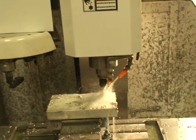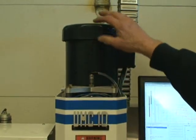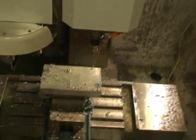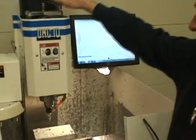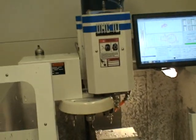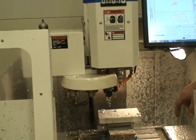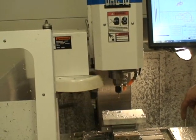Why it's noisy is this motor is an enclosed motor, drip proof, so it has a fan up here. When this spindle is going 6,500, this motor is going almost 11,000 RPM. Now you'll hear the air blast when it comes over here and blows the chips off the tools.